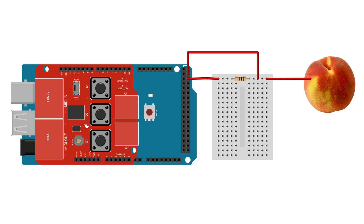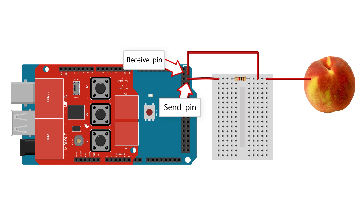In this circuit we use two pins on the Arduino. The bottom pin that goes to the resistor is called the send pin, and the pin above that going back from the other side of the resistor is called the receive pin. The send pin sends five volts into the circuit and the Arduino keeps track of the amount of cycles it takes for the receive pin to receive the five volts. It always takes a little bit of time for current to travel, albeit very little. This technique works because it takes more time for the receive pin to get five volts when there is a capacitor in the circuit storing charge. In my setup the peach will store some charge, but when the peach is touched by my hand I will also be part of the circuit and store charge. So touching the peach will increase the time for the receive pin to receive the five volts.